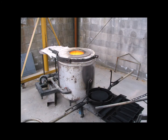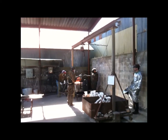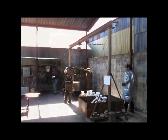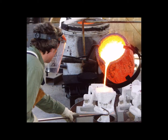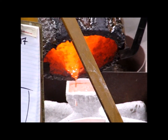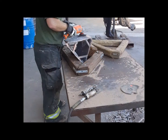The ceramic shell is a refractory material that can withstand high heat. We start melting bronze at 1800 degrees and pour it into those ceramic shell molds. The crucible holds 300 pounds of bronze, and for this sculpture that eventually weighed 900 pounds, we had to pour six 300-pound crucibles.